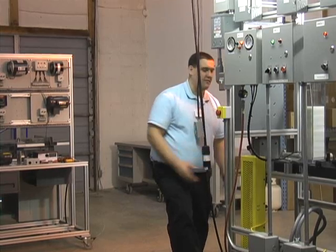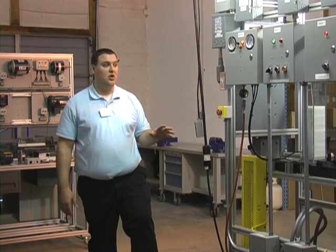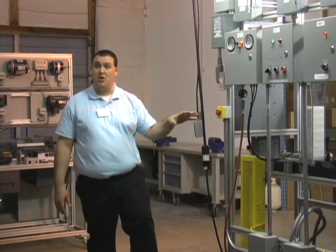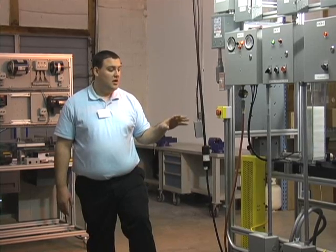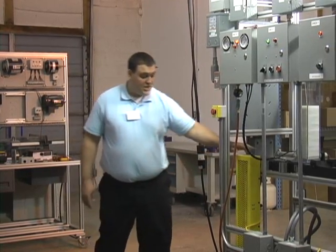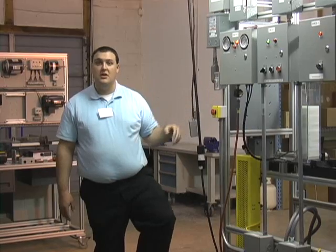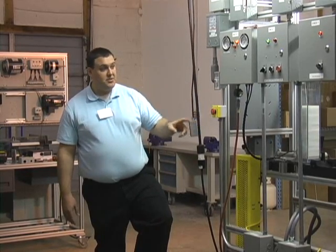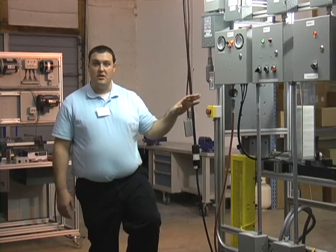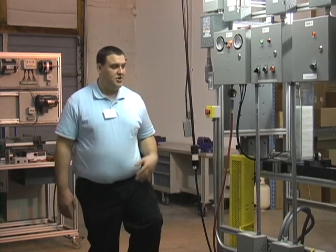Once the students have put in the electrical infrastructure and built the frame, they'll continue to install the rest of the components to run a continuous process manufacturing cycle. There's a MAC parts feeder that runs batches of parts through a simulated paint-baking-cool cycle that's PLC driven. They'll begin by installing an AC motor with an electric brake that runs through a chain drive. The chain drive has a safety disconnect limit switch wired into the start-stop circuit, and there are several e-stops — two in the front, one in the back — plus a couple of start-stop control stations for manual loading and unloading of the conveyor belt.